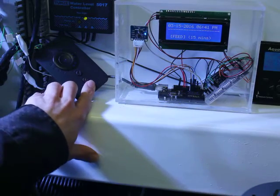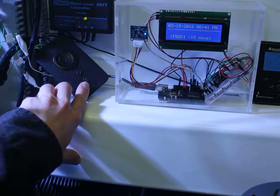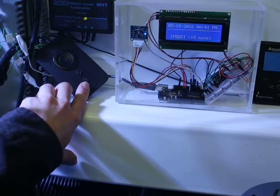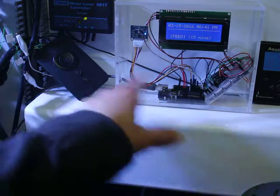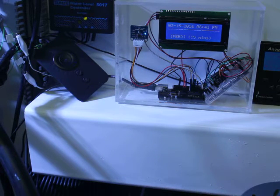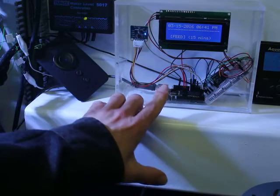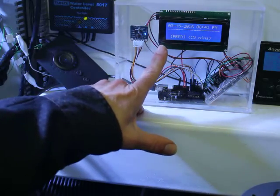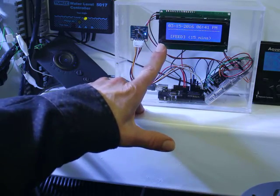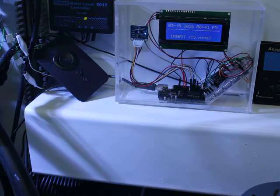What the Giri Mod Controller actually does is push that button for you. The relay module is wired into that button and shorts it out to press it. What it does is handle things on a schedule — you can program a certain amount of time at one mode, then a certain amount of time at another mode, at different times of the day.